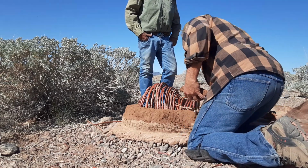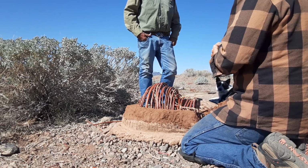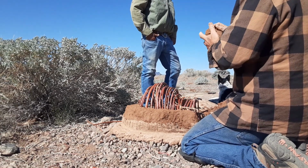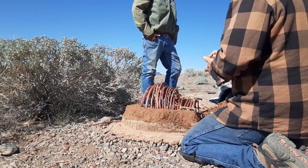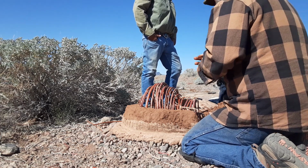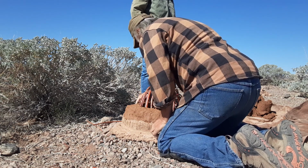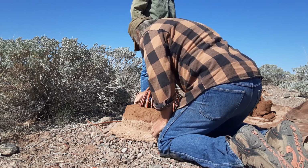I'm planning on doing straw bale and clay on that one building I got up in the UP. I'm looking forward to it, because that'll be good insulation up there, as long as you got a good roof and your foundation ain't bad. Yeah, the building is all timber frame. That's perfect for that straw bale scenario. I've done straw bale before too, and then, you know, chicken wire getting stuck on it. They're having a seminar weekend thing on that adobe straw bale stuff over there in California.